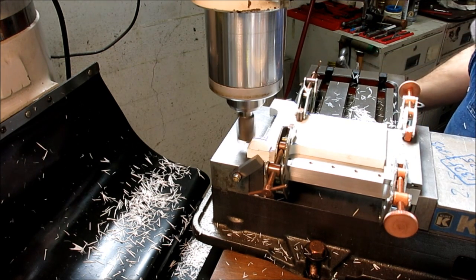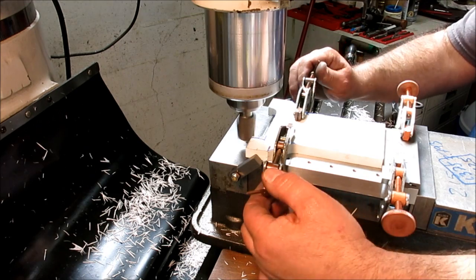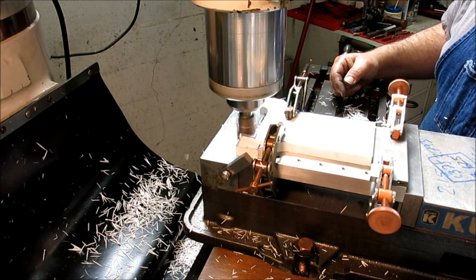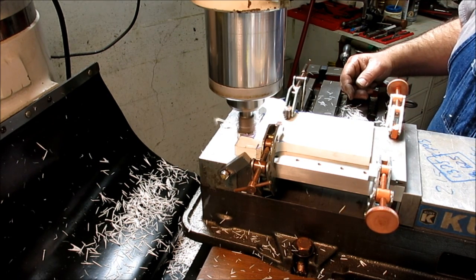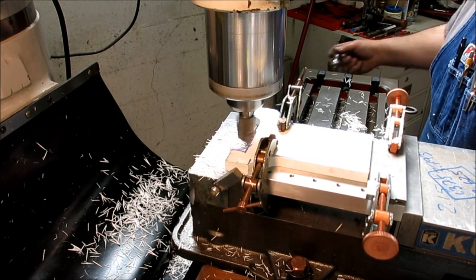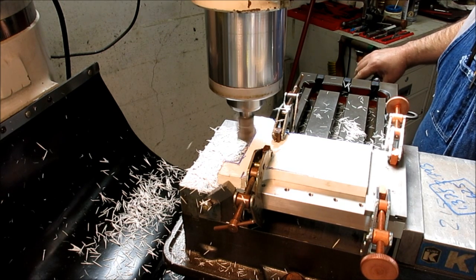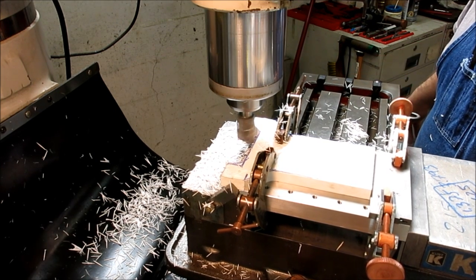Put that for absolute. And my numbers are 1.375 for the first pocket. Let's see, make sure I'm tight here. Or the first edge in this direction. All right, I'm going to come in, and I'm going to come into 5/8 deep, 400, 500. I got a ways to go. Oh yeah, I got plenty of room under there. 625, okay. I'm going to drive along there, nice and smooth, to 3 5/8. Okay. 625, and then I come out. That's it.